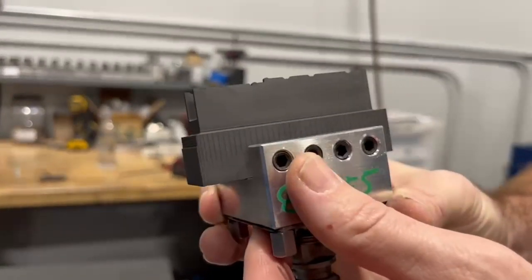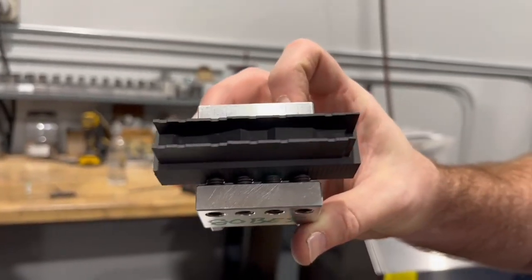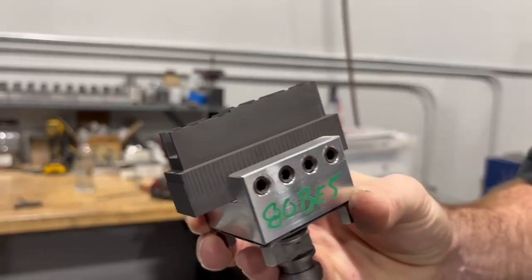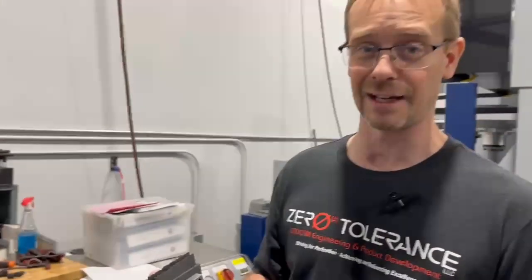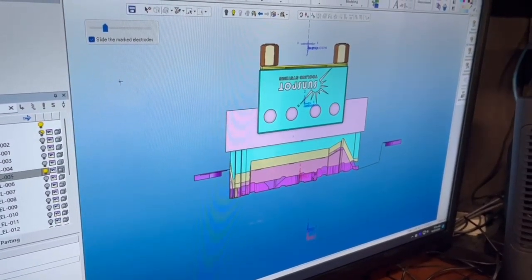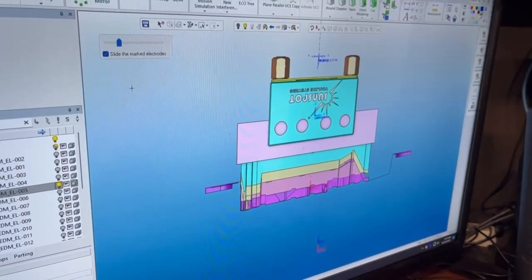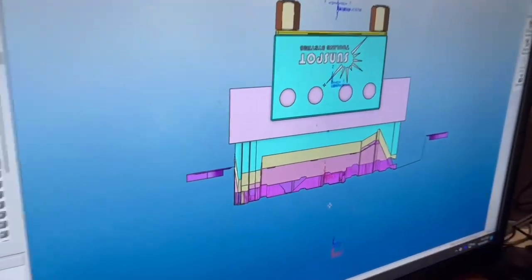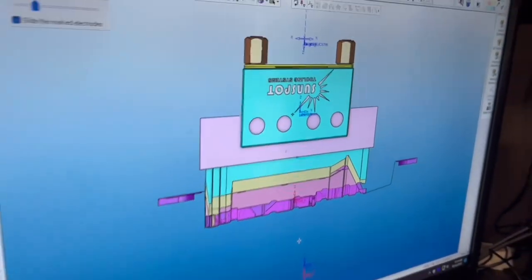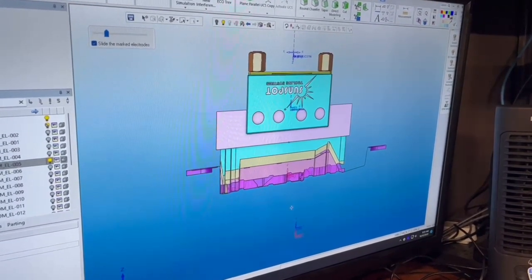Here's the shape we need to put into that area on this particular job. It's got a couple of deep ribs and sharp corners at the very bottom, which you cannot do on a 5-axis or even on a 3-axis — sinker EDM is really what you need here. Zooming in on these features you can see sharp corners, and there's no way to make that cuttable, so electrodes are needed in this instance.